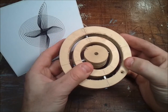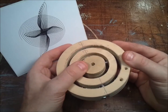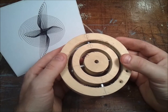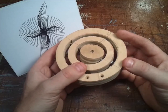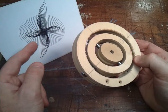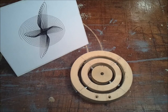The harmonograph that I would like to build would use two compound gimbals like this. The machine we just saw running was really just a prototype study for building that harmonograph — it obviously only used one of these compound gimbals. But when you use two, the drawings are much more complicated and much more beautiful. Later I will be making a wooden gimbal that uses bearings to help reduce the amount of friction on the gimbal, which is ultimately what causes the decay in the elliptical orbit that we saw. So wish me luck, and I'll try to build a nice harmonograph and show you later. Thanks a lot for watching.